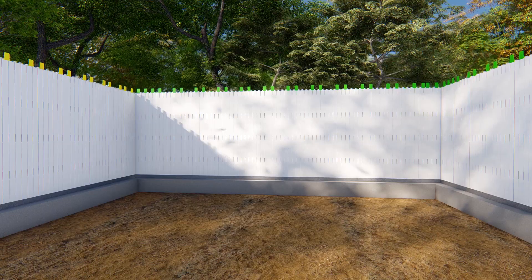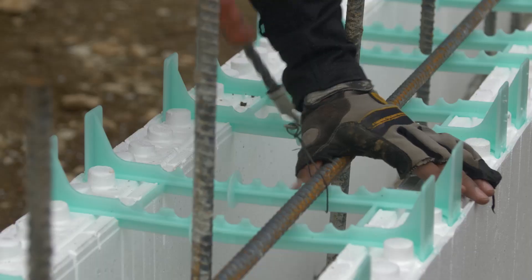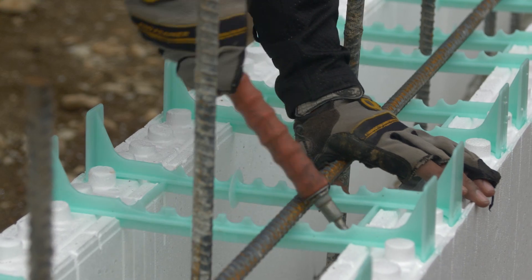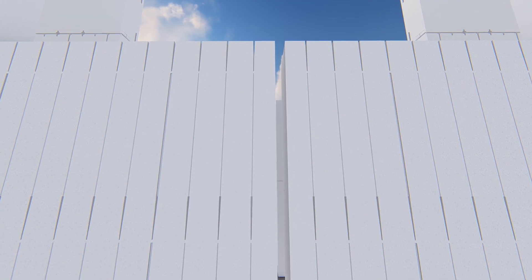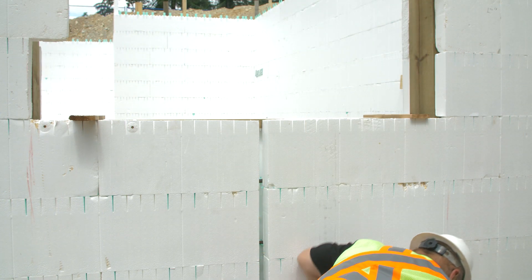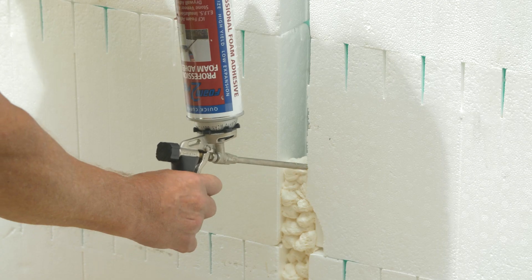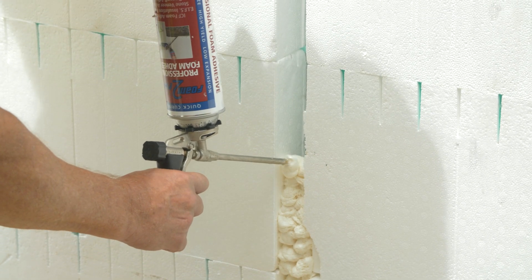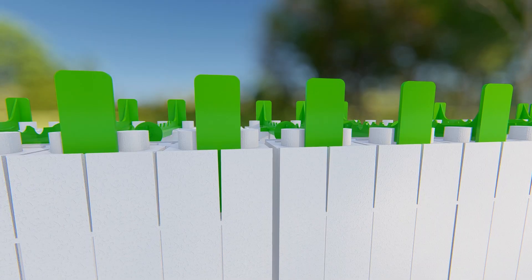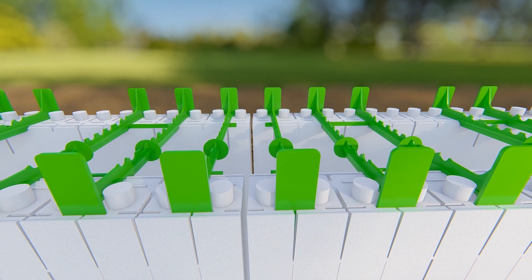Continue stacking walls to the four foot level by repeating the panel pattern from the first and second courses, placing horizontal rebar in each level as you go. Deal with odd dimensions by creating a common seam at mid wall and running it up the entire height of the wall. Remember to leave the common seam open to allow for adjustment in the wall length. Larger gaps are easily filled with spray foam. At each level, place a split tie as close as possible to both sides of the common seam.